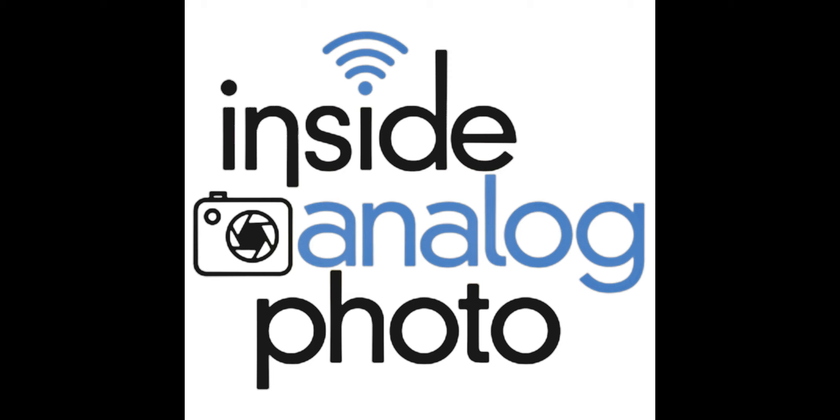I did some thinking. My background is actually in electrical engineering — I've been an aerospace engineer for 10 years and I'm making a transition thanks to the economy. I already had Pocket Wizards, and I know radio transmitters are the most reliable. So I basically took one of those little optical slaves you can get for $15, hacked off the plastic lens from the front, and glued it onto the front flash of the Instax — giving me an instant hot shoe. Fuji says they use an F11 lens, but according to my meter it's more like F6.3.